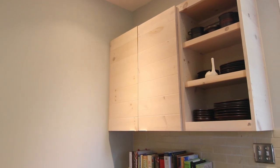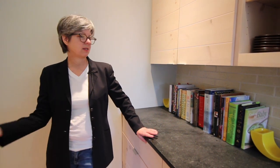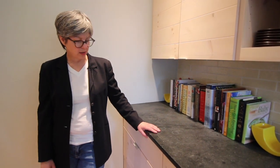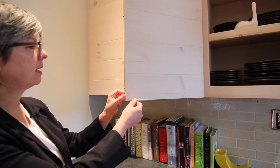So we ended up buying this pine and had the cabinet maker fashion it into the faces of the drawers and doors. Then we had the cabinet maker put some light washi finishes on it. The finishes were good, they would have held up great, but they looked too hard and shiny. So we just took it back even further and had Robert McAnulty do a paint finish on them, essentially, and seal them. So they just look like whitewashed pine, which is what they are. The fronts on these doors are just thin V-groove pine applied to the front of the cabinet face, and then they have a paint finish and a clear finish on them to get them to look the way we wanted to.